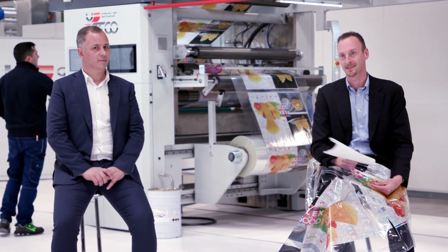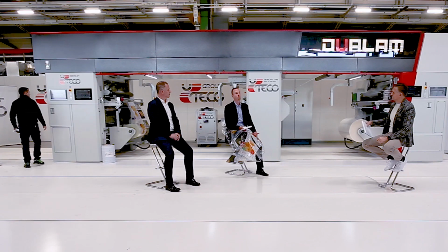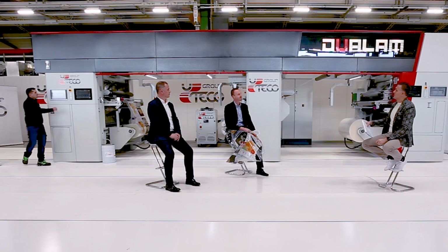Another fundamental feature of the machine are the control groups of grammage for both the components, supplied by Sinaptik, which is the third strategic partner of this cooperation. The Sinaptik control panels guarantee an inline, efficient and constant control throughout the process at low and high speed, so that we can ensure that in any phase of lamination and work, the grammage of the components is steady, guaranteeing an inline control of the quality of the finished product.